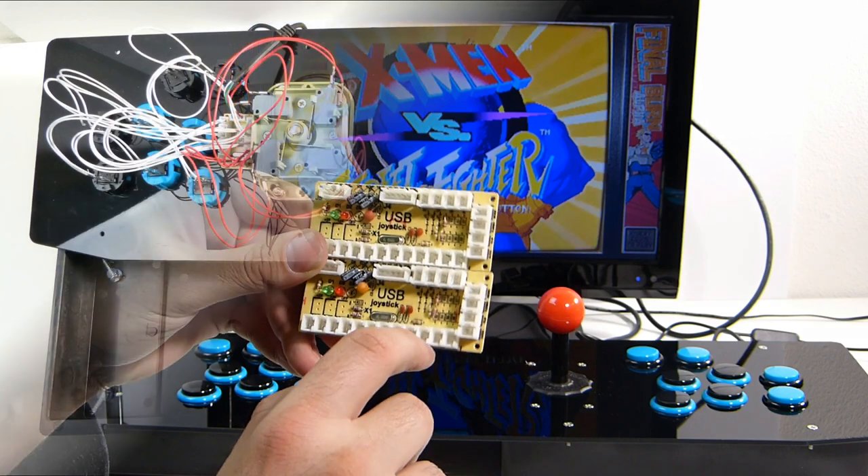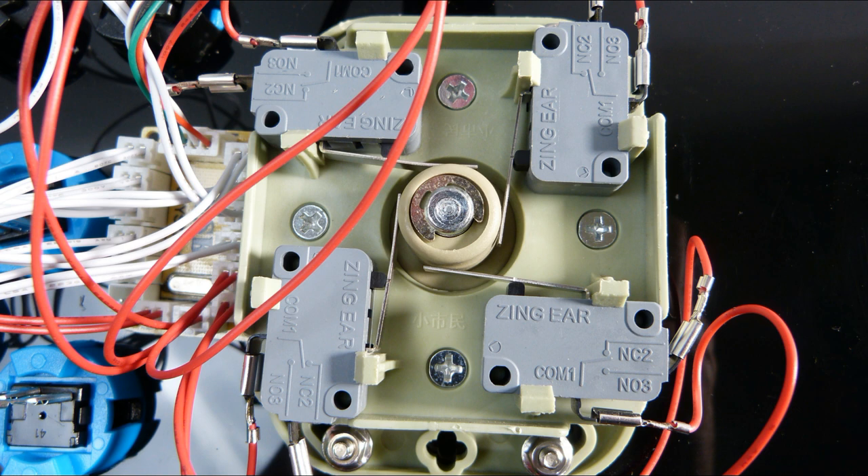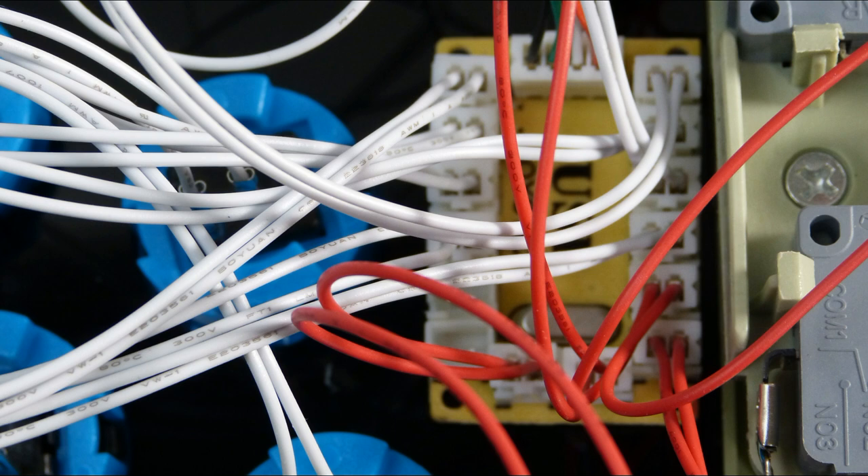Here is the stick with the top removed — all the wiring, buttons, everything. Not the neatest job possible but it gets the job done; you could do a little more cable management, but everything works and is secured nicely. Taking a closer look at the actual arcade stick, it seems more of a Happ style. The microswitches seem pretty clicky and nice. This is the USB encoder they use, and I've diagrammed it out, so let's take a look at the diagrams now.